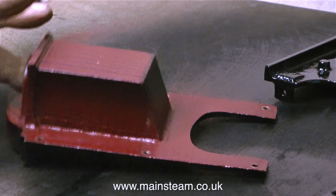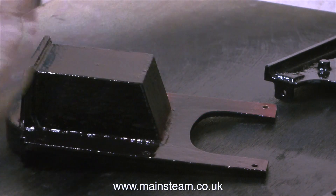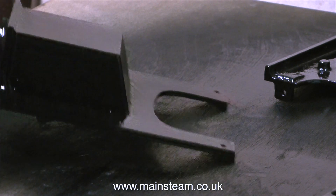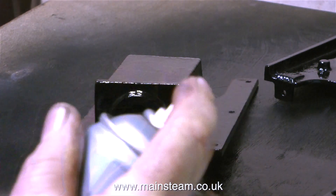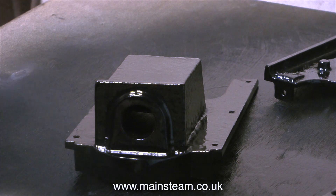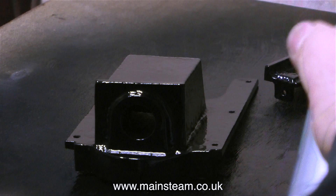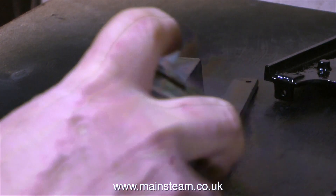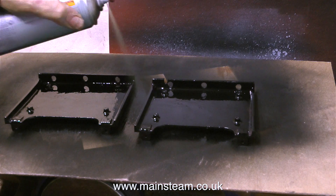The odd thing about this boiler casing casting is the front part — this is the part that holds the chimney — is made from either brass or gunmetal, a non-ferrous metal. Whereas the rear part is made from cast iron. That's the part that was broken, that I fixed with some JB Weld and a small metal plate to bridge the gap. I think the repair will be very successful. You can see it from the inside, but you can't see it at all from the outside because it's on the line of the fake brickwork cast into the part. Whether my painting technique is right or wrong, I don't much care because I don't get any drips usually and I get a very good coating. I start with one thin coat, then I go over with another coat and eventually I apply quite a thick coat for the final one.